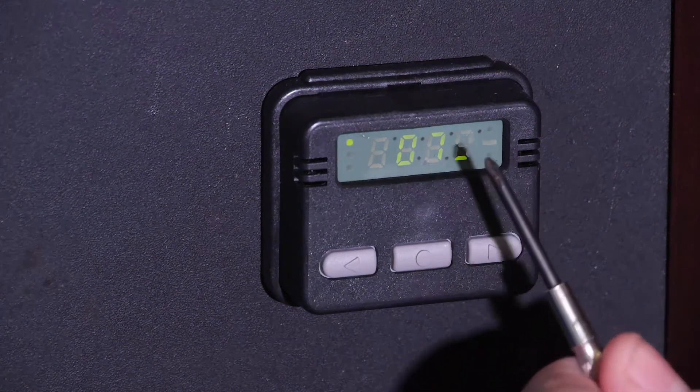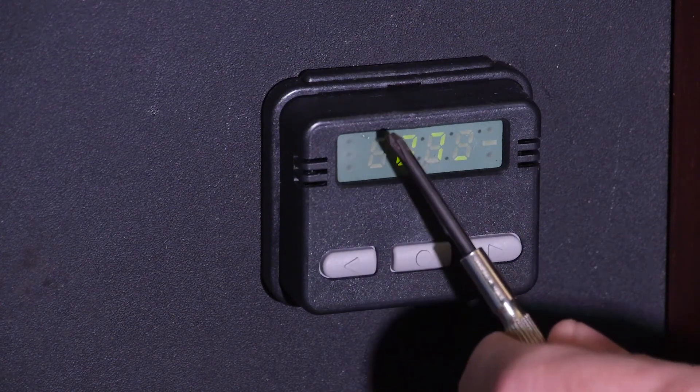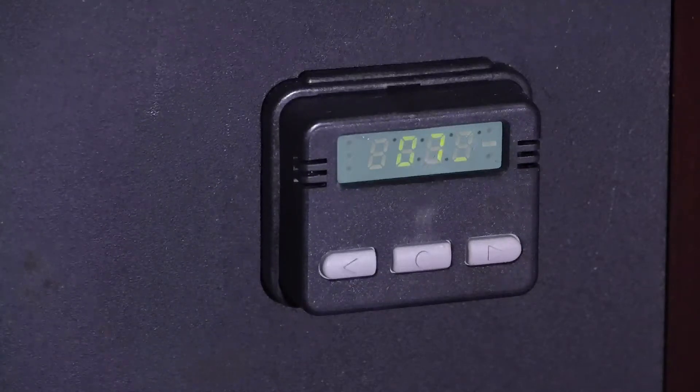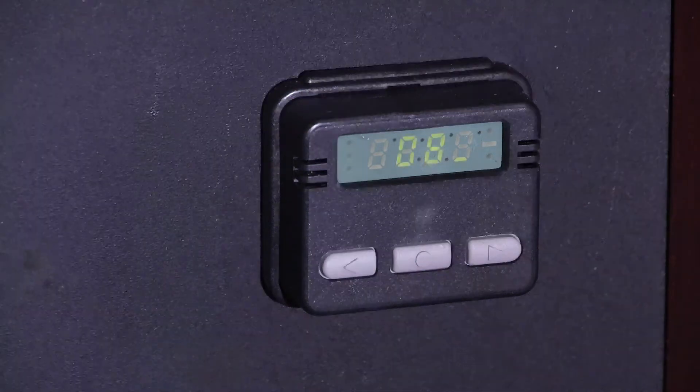The first time power is supplied to your diesel heater, the controller will show the surrounding temperature with a slow blinking light on the left side of the display, indicating that the heater is in standby mode. The display turns off after a few seconds. You can operate your heater in two modes: temperature mode and power mode. Power mode supplies constant heat regardless of the space temperature — you can adjust the amount of heat output. This mode is good for applications with a lot of heat loss, such as open cabins in fishing boats.